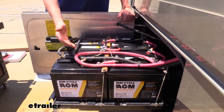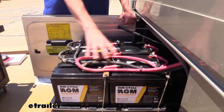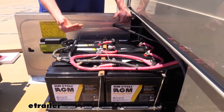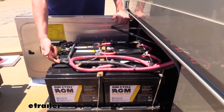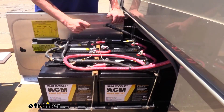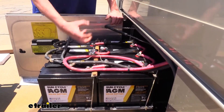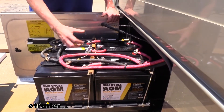That being said, one of the things you do need to be careful about with AGM batteries is that since they are completely sealed, they don't like high temperatures quite as much as your vented batteries do. You can see we've got a temperature sensor here, and that's why we wanted to make sure our solar charger on the inside is set for AGM, so that it has the appropriate charge strategy and isn't overcharging these, causing them to overheat and potentially damage the batteries.